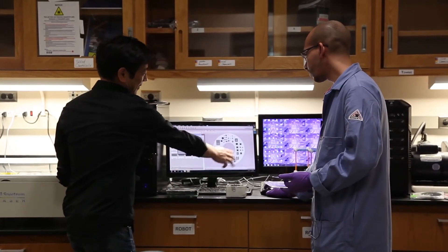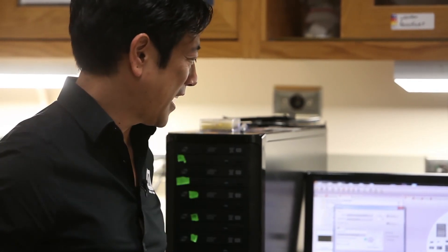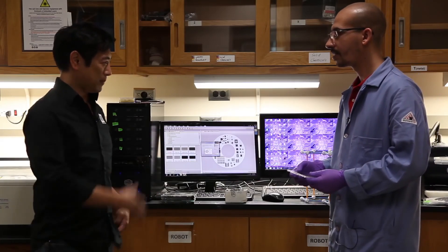In your label maker you've got all these patterns. So these patterns are just where the graphite oxide is going to turn into graphene. These patterns are placed so that after it's been scribed here, it will be like a graphene supercapacitor. I see a lot of these are kind of traditional capacitor shapes — parallel plates and things like that. That's what it is. So you just print it on and then about 13 minutes later you get the CD with the graphene made on top. We've since moved on to making it at a larger scale — I can't go into detail because it's proprietary — but we just make graphene supercapacitors now on a larger scale. So in about half an hour, you just have a disc full of supercapacitive material.